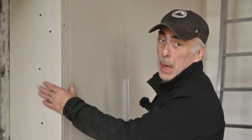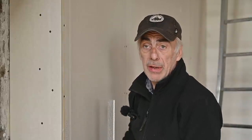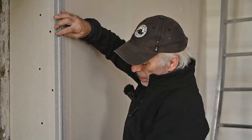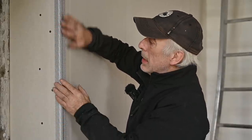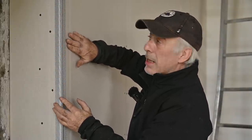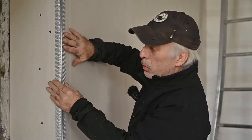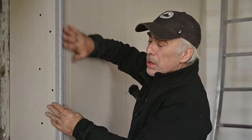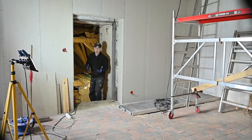When installing drywall you'll sometimes end up with an outer corner or inner corner. Inner corners — just place the panels together. I typically don't fill those with joint filler because it will crack; instead I use a paintable silicone, which stays elastic. Outer corners, like this doorway, need protection because people will bump into them. You need to install a steel enforcement strip on it, which gets plastered in. That's why it's important that the slanted, thinner sides of the boards face the outer corner — otherwise you can't plaster it in nicely. Always enforce outer corners.